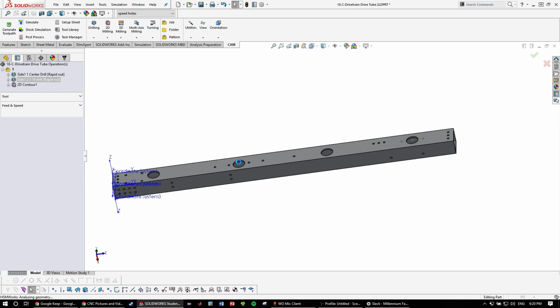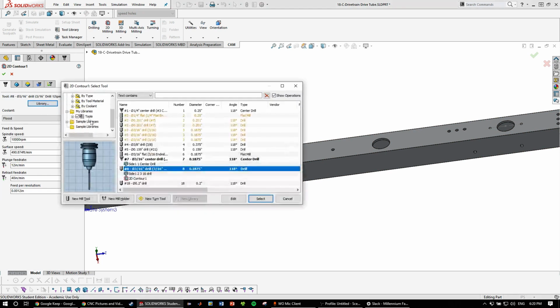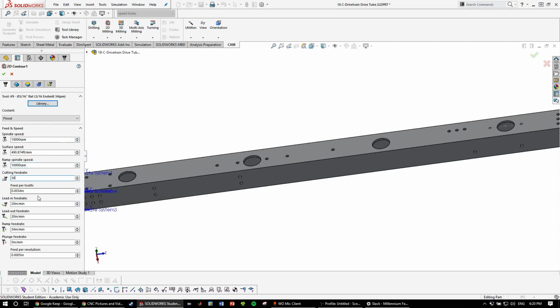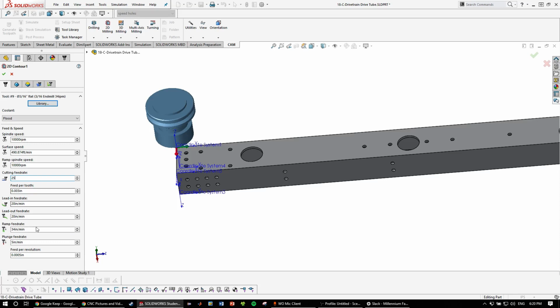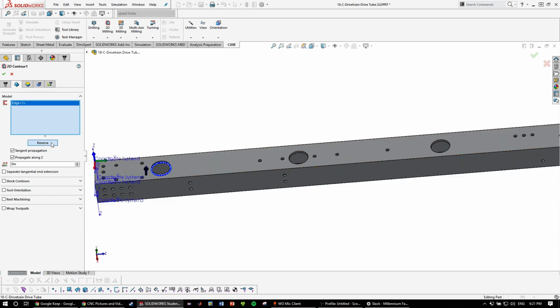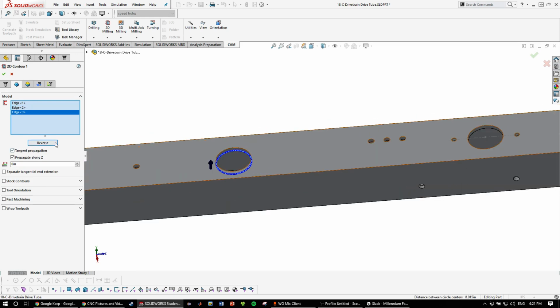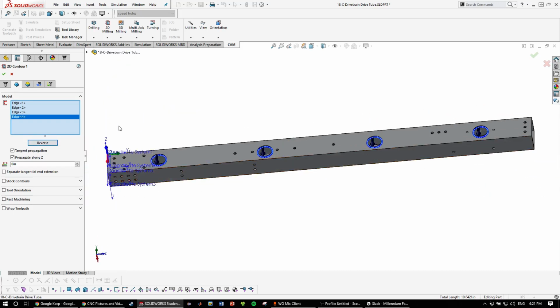And then we're going to want to cut out each of these bearing holes. So we'll be using the 3/16 end mill as usual. The 30 IPM. Actually, for the tube, it gets a little weird because it's sometimes not as rigid, and so I like to run it a bit slower, at about 25 IPM. And the model, I'm going to select proper holes. 2D contour once again. What's nice about the tube is that these cutouts don't actually fly out of the tube. They just sink right down inside the tube, just like that.